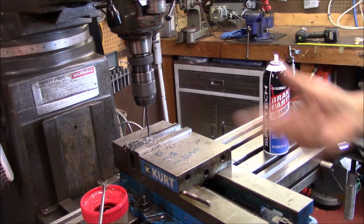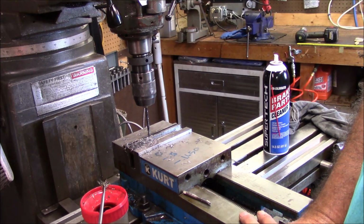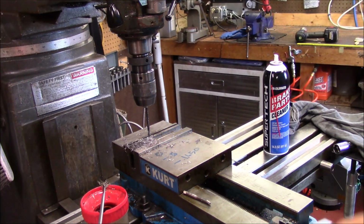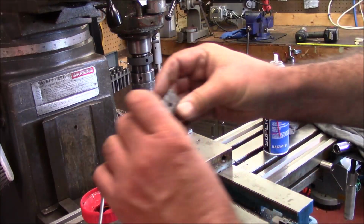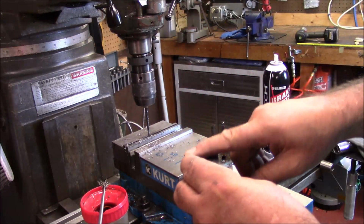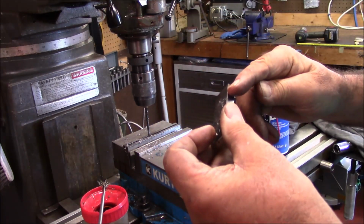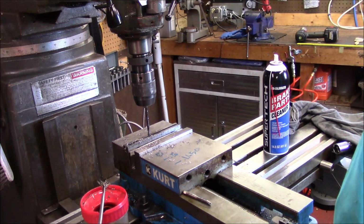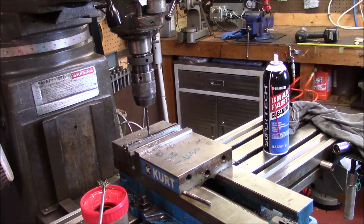Then we'll just put a little 15-degree angle on. What I'm going to do is I'm going to set this up. I'm either going to take the mini pallet and go ahead and put the piece on the end and then angle them or what. I'm not sure yet. But what I'll do is I'm going to come back and I'll mill these slots later. And then what we'll do is we'll put a 15-degree angle right here along the edge. If this falls into this a little bit, it won't hurt because we're not going to tape it a bit. So I'm going to put like a 15-degree angle. So there's my first one. Then I'm going to deburr them also. That's how we're going to do it. That's the whole plan. So I'm going to put you to sleep, as Harold says.